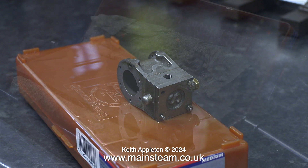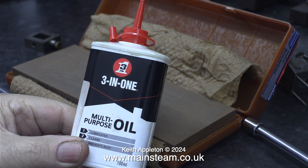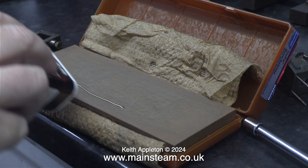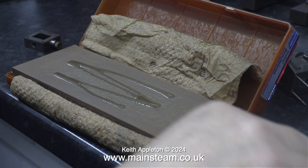Normally I would use wet or dry sandpaper on a piece of steel plate, but then you have to hold the sandpaper in position. With a whetstone, it holds itself in position, as it is indeed a piece of stone. It may be a synthetic product — I'm not really sure how they are made — but it really does the job, but you do need some oil to make it cut properly. Here I'm using some 3-in-1 multi-purpose oil. Not too much, just enough.